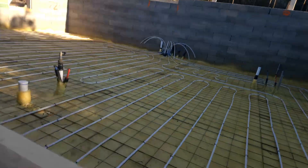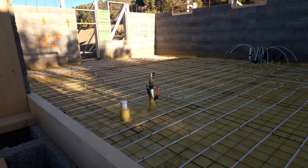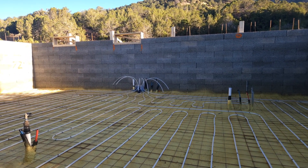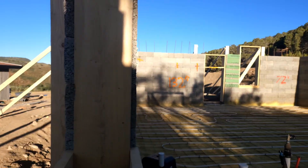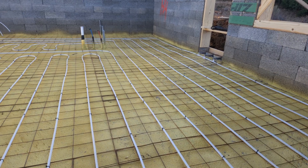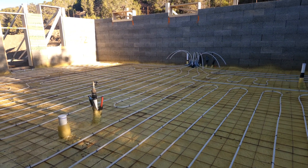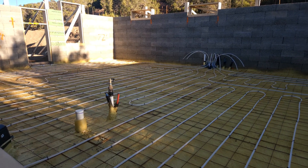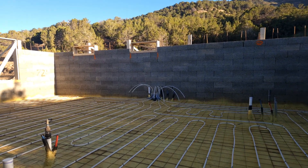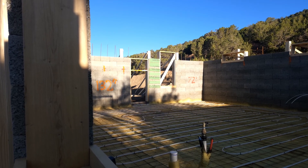We also laid out all of the radiant tube. I'm doing a 6-inch slab, and on that slab we got our radiant tubing on about one foot on center. We're going to have an island, utility room, pantry, boiler, washer and dryer in the large pantry, kids' room in the corner, and our room up front. The spray foam under the slab came in not perfectly flat — maybe within about an inch, whereas I had the gravel within about a half inch. It's pretty nice to work on though as we're doing the radiant stuff and wall work. In the middle there we've got a pilaster with hollow blocks, so hopefully we don't have any issues pouring those.